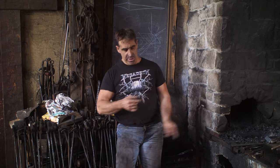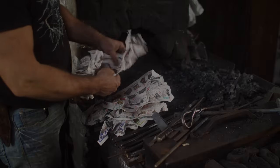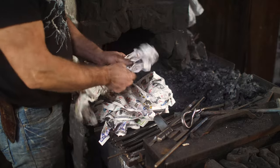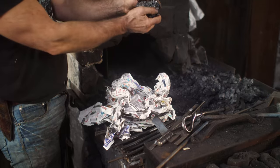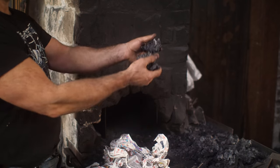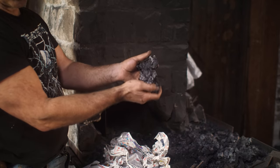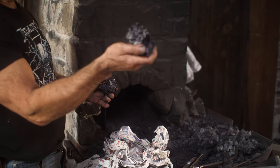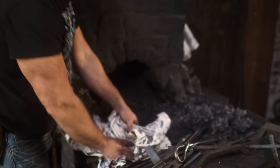I'm going to start by lighting the forge. When lighting a coal forge you start with your previous fire and the coke which you created during that fire. So this is coke from my previous fire. If you're doing your first fire then you might have to burn some pieces of wood, get some coals going, get your green coal going and then start getting some coke. But once you've got your first little bit of coke, you save that stuff like sourdough and use it to light your subsequent fires.